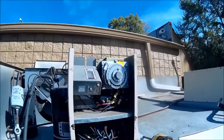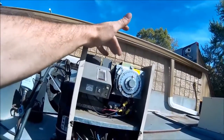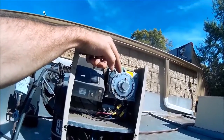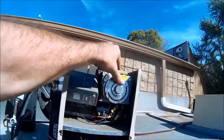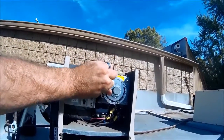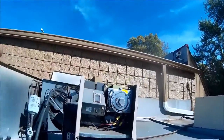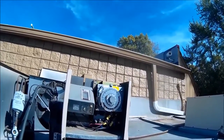Let me get this one out. I'm just going to basically do it wire for wire — not really too much to it. They got this set up for 60 minutes of defrost. It's a cooler; it doesn't even really need defrost, but it's on here so we're going to replace it. Let me get it off, and then we'll watch how the new one works and make sure everything is up and working right.